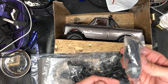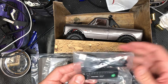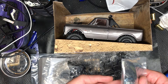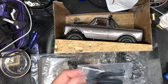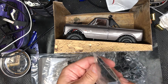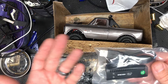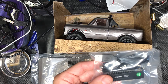I'll create my own battery charging lead. This is the USB charger, which in essence would be great for on the road — you could plug it into your phone battery bank and charge it up. I've just found that it probably overcharges the battery, doesn't do it at the right amperage, and there's no balance charging.